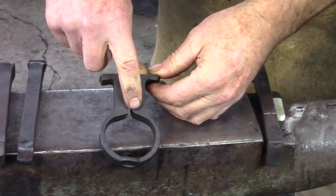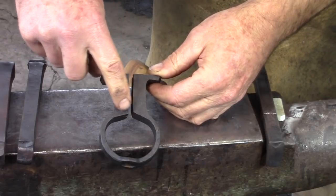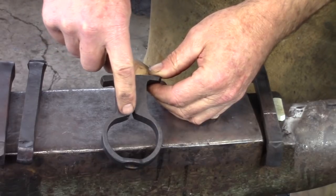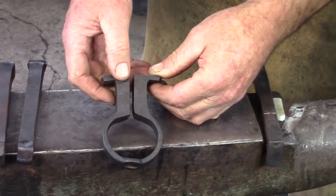You can see I was a little too vertical with my shoulders here. The more slope you have to the shoulder, the more this is going to feed into the circumference of the spring. The steeper it is, the more it's going to look blocky like mine. If you can get more of a slope, you'll have a more graceful entry into the spring material.